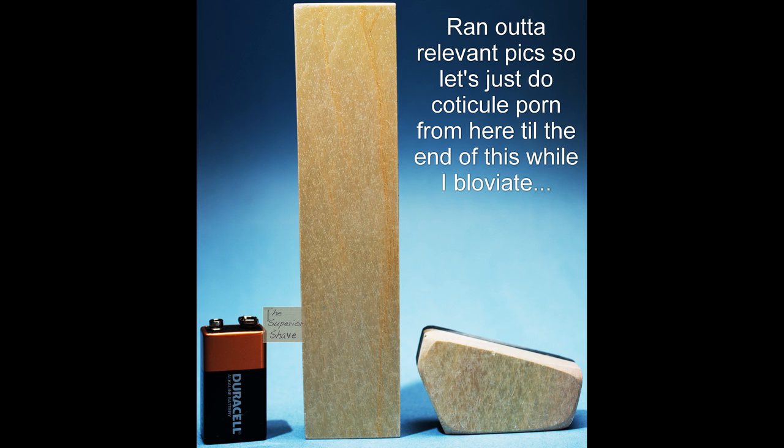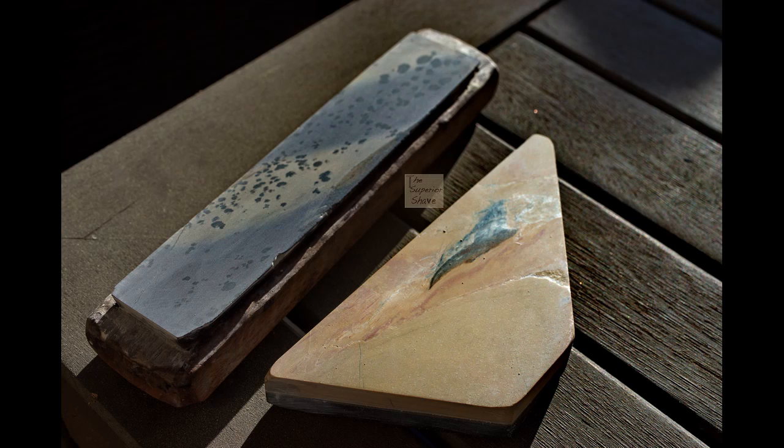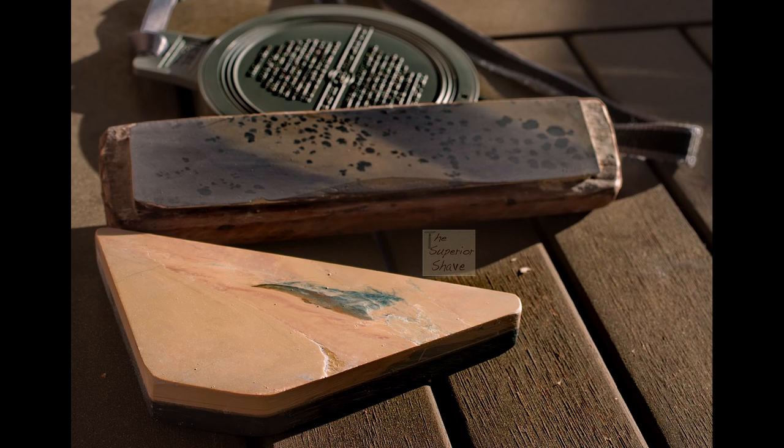They do it to guarantee that all of the blade touches. I did notice somebody pointing out that making contact with a very small portion of the blade on each stroke would lead to many more strokes — and that's true. But you have to understand, some coticules can be blazing fast at their minimum speed with plain water. And if you have a really fast one that's hard and has lots of garnets, it doesn't matter if that contact patch is a tiny little thing — you're going to be working pretty quickly.